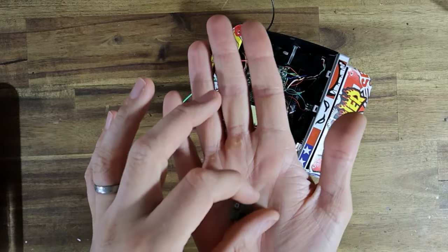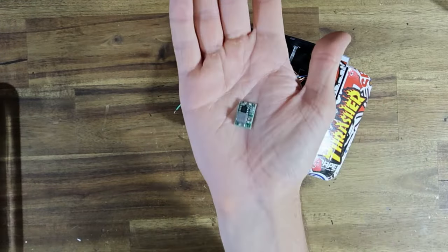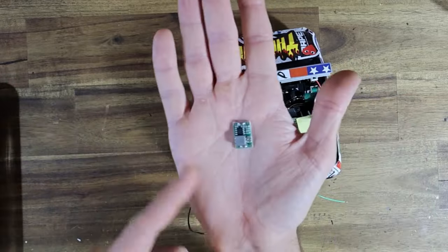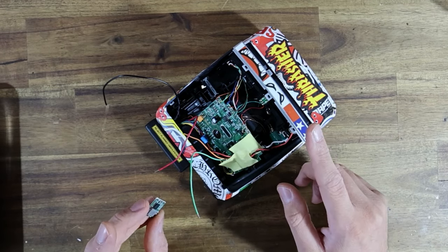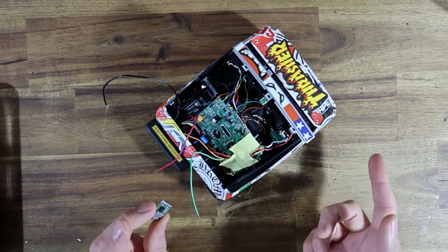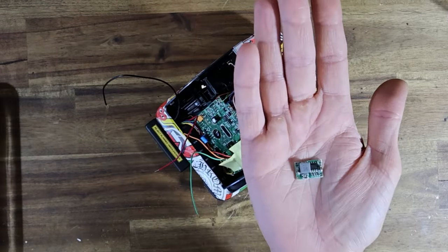It outputs a maximum of 3 amps at its peak. On average, it outputs about 1.8 amps, which should be ample for driving this camera. The only thing that I may have to install on one of these is a smoothing capacitor on the end of the voltage that goes to the camera. The reason being that I believe this has some kind of autofocus mechanism inside, and it may work better with the voltage smoothed slightly. So I may have to add a capacitor afterwards, but for the purpose of this video, I am going to wire up one of these bucks and then test this thing out.